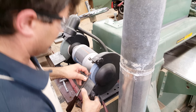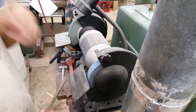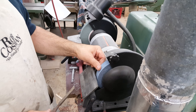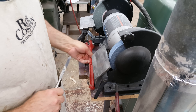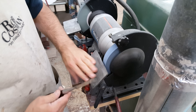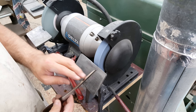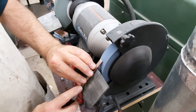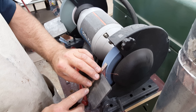I'm just going to guess at the angle at first, then lock that into position. I like to have that face of the grinder wheel really opened up, and I do that using this style of wheel dresser — it makes it very aggressive. I'm not going to film all of this, but it's going to take a while. When you're dealing with grinding a new bevel like this, you can't rush it. You have to go slow and avoid burning the chisel.